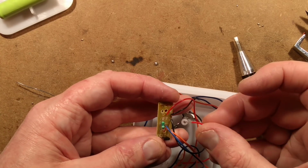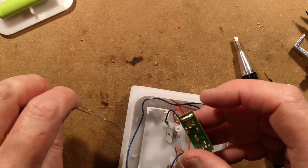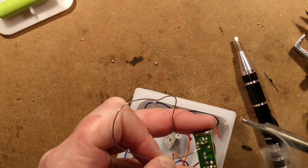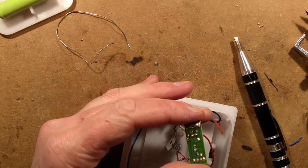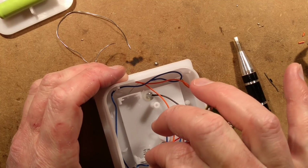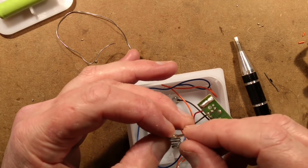And the positive solar connection is going to a common positive connection up here. Okie dokie. So I shall solder that, and then as long as I put the battery connectors back into the holder, if they're going to reach their holder, and I put the battery back in, that should be it done. That should be now a little module that will now be warm white instead of cold white and not have a switch. This could do with being bent just a little bit.